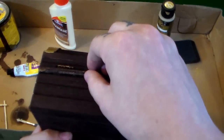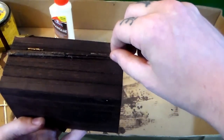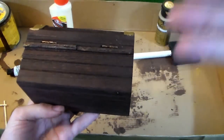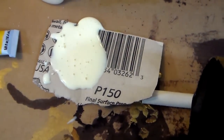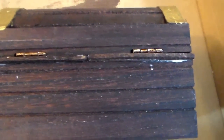So like I said, stain these planks and then put the glue thinly on there, place them together, let them dry for about an hour or so, and make sure they're already staying. I have four planks — two of them glued to each other — and this is going to expand across the whole back of the chest. One's going to go right under the hinges and another right here, not laying down but protruding out to give more leverage to stay up. So I have it propped up like I want it, all glued. You want to race against the clock with this stuff since it's fast drying. It looks like a snug fit — if it protrudes at all, just sand it down a little bit. That's how you add the prop to the top.